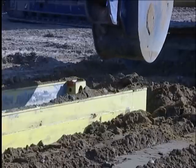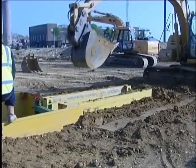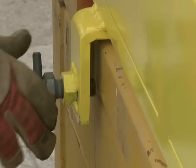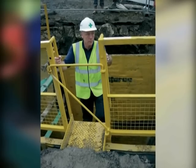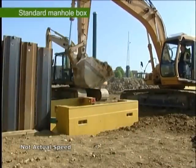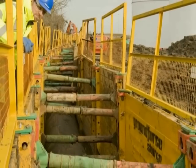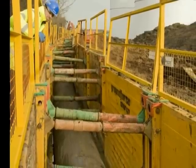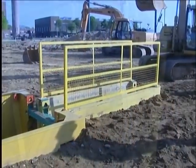The total depth that can be supported will depend on the predicted ground pressure; if there is any doubt, consult Ground Force. Once the final depth is reached, handrail panels should be fitted for greater safety around the top of the trench. Ladder-safe combined handrails and access panels are available for most box types. This installation method is a standard process which can be followed for all types of trench boxes and manhole boxes. Trench boxes are intended to be installed in multiples, end to end depending on the length of the trench to be supported, with boxes being leapfrogged as the pipe laying and backfill sequences proceed.